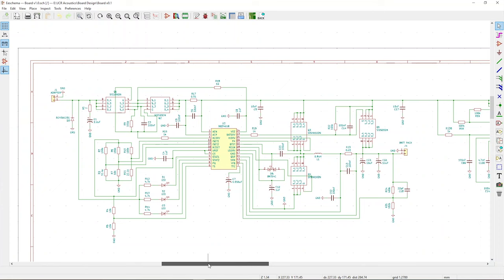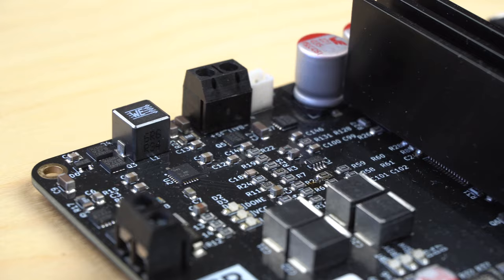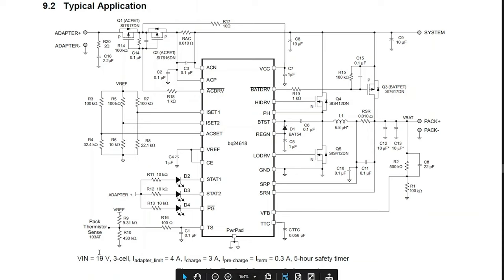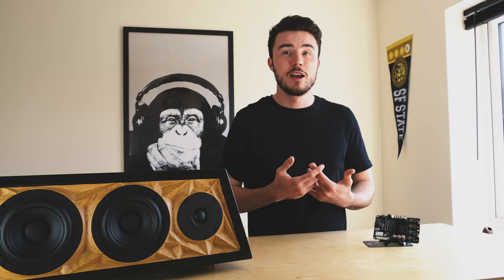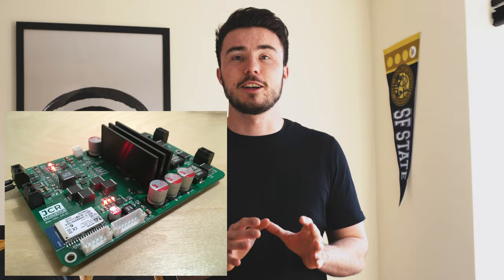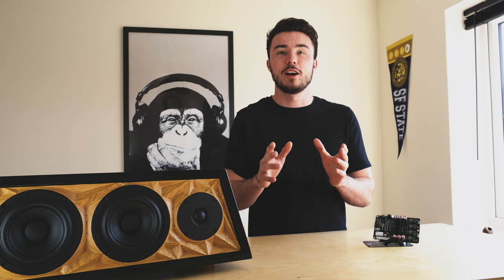Finally we have the power input stage, which allows for smart battery charging as well as latching power on and more status LEDs — because more LEDs equals more cooler. This might look really complex, and it is, but fortunately it's pretty much just a reference circuit from the datasheet. The difficult part was the PCB layout itself. My first prototype, even though all the connections were technically correct, had a charging circuit that simply didn't work. It took sending my board to a real electronics engineer for analysis, plus two expensive hours of paid Zoom calls and three prototypes to finally get it right.